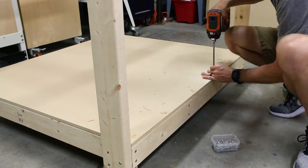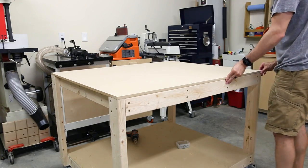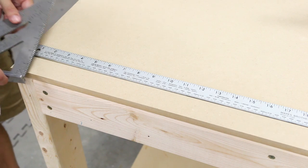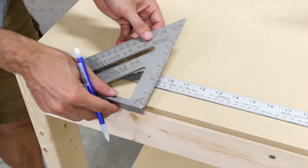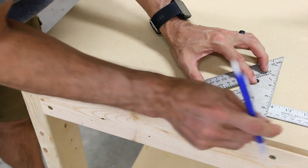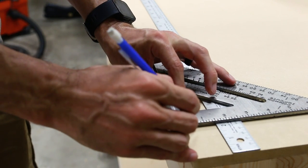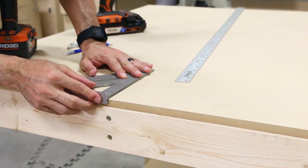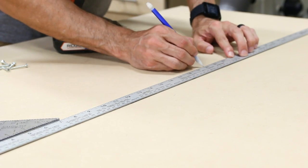I'll show you how I laid out all the screws on the top piece. The top lines up with the corners and is flush on the front but will have a small overhang on the sides — I plan on using that overhang for something later. I used a combination of a metal ruler and a carpenter square to quickly lay out my screws. I lined the ruler up flush on one side and overlaid the square at every 8 inches, then made a mark three-quarters of an inch from the edge to center the screw on the 2x4. For the inner bracing I visually lined up the square with the front screws and made marks every 10 inches along the brace to make sure everything is secure with no bounce.